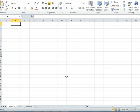All right, so what I want to do is find IDSS times 1 minus VGS divided by VGS off, squared. Okay, so that's what I'm looking for right there.